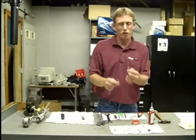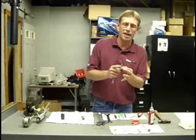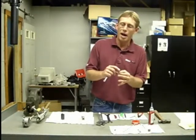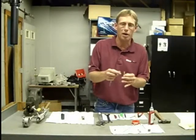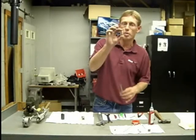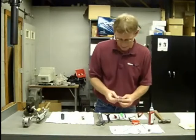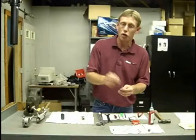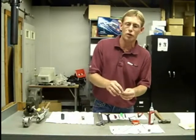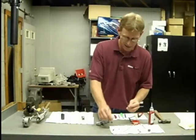In the transfer housing there's a soft nylon seat. Do not try to remove this nylon seat — that seat is machined in. You should not have wear in that seat because catalyst isn't abrasive. But if the seat comes out or is damaged, you will need to replace the housing. At the least, use a Q-tip or something to clean it out. Make sure there are no catalyst crystals down in that seat and that the seat area is nice and clean.